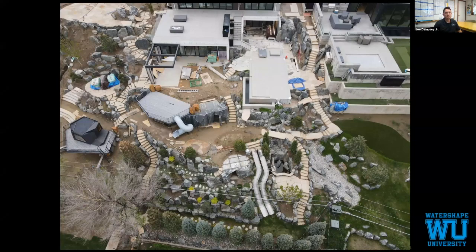I bring up one thing: when we get into projects of this caliber, you start getting into shoring and shoring engineering and a number of other experts that have to get involved. It takes 10 extra levels of expertise when you get into projects like this. So in addition to swimming pool side, hydraulics, the movable floor systems, there's a whole another set of engineering that gets created just to be able to excavate a hole this close to a project and at these kind of depths.